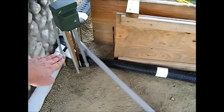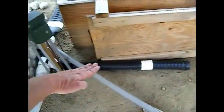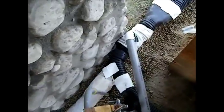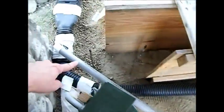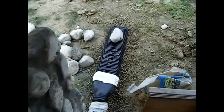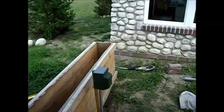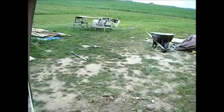We put the sleeve socks on here to keep the debris and the mud out. We put a Y on here — you can tee it, but a Y is what we had — and we're just going to run a short piece here and a short piece here. This is our water pipe to the drain plug to the pond, so we'll be able to just pull the plug and drain the pond right out into our drainage system. We put on a flat landscape-style drainage system, the kind you would put on the downspouts of a house, because we want everything to slope down and out into the city drainage ditch.